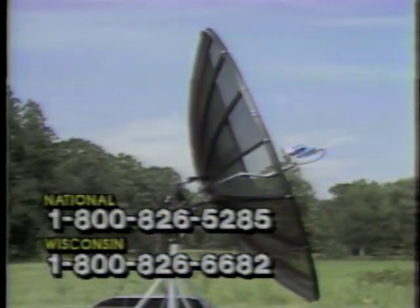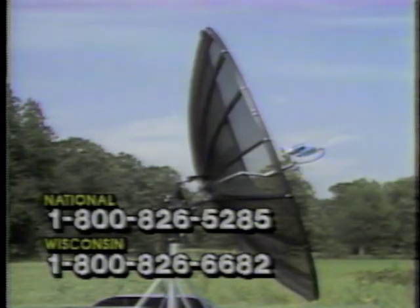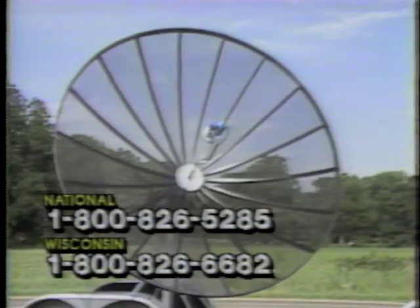The M120 is a full 10-foot dish for maximum gain with an F/D ratio of 0.28 and a full 5-year limited warranty. The light weight of 165 pounds permits simple rooftop installations. Built solid and tough with a survival wind load of 120 miles per hour thanks to its 70% open area. It comes in black or aluminum. You'll be looking through it in your neighborhood soon.